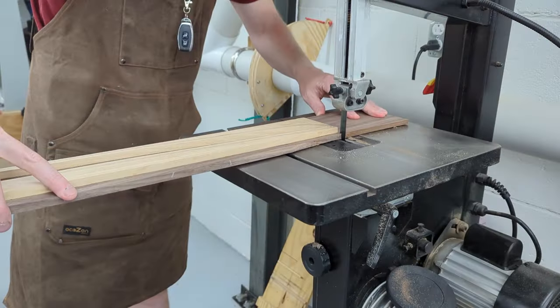In order to get the freshly glued side to match the rest of the saya, I turned to the router table. After a quick bit change, I use a flush trim bit that makes quick work of, well, flushing up the sides. This is why I left it a little oversized when cutting it out on the bandsaw before. I take care of the end with the opening, using a Japanese pull saw which leaves a clean, flush cut.